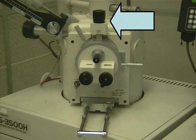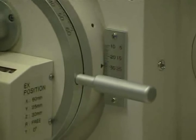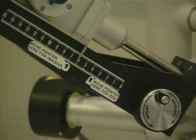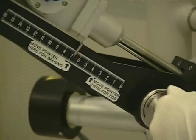When moving your sample in the chamber, remember which scale you used when aligning the height of your sample with the height gauge. Using the wrong scale can crash your sample into the lens. In case you forget, the Exchange Position sticker on the right side of the SEM has the venting position listed on it. When doing imaging in the SEM, make sure the EDS probe is set to Imaging. There is an arrow on the scale showing the correct position for imaging — rotate the knob until the arrows line up.